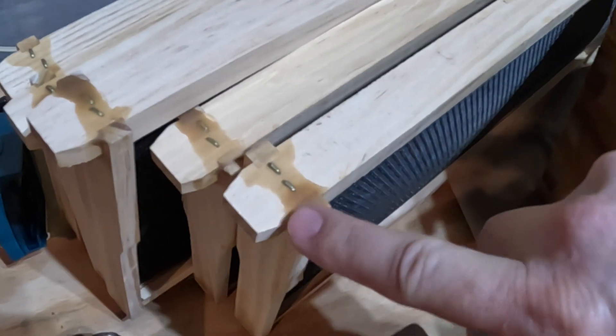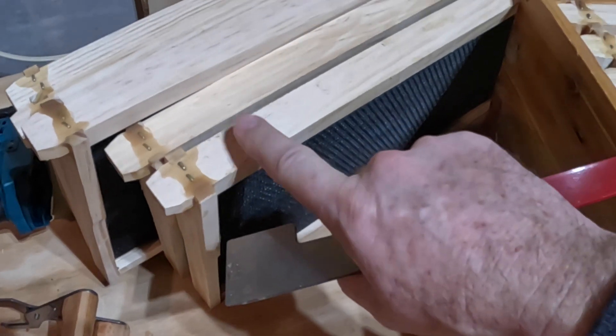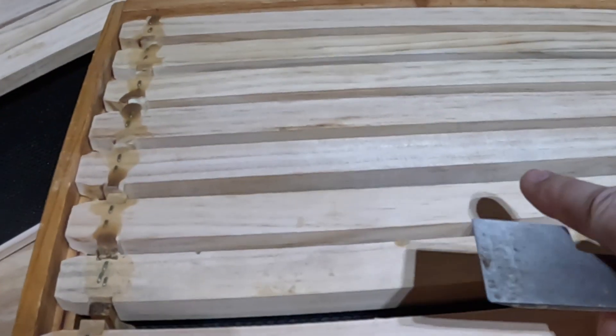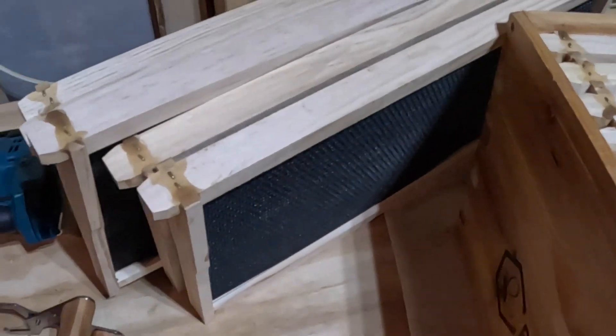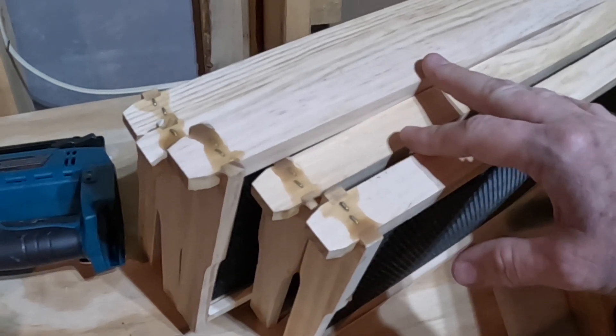On frames that I've recently made — and I've got a stack of them right here — I make sure there's a ton of glue. I put staples in them too. Glue is the key; the staple or nail is really just to make sure it's glued together well. So many times on YouTube videos you see people working frames and you don't see many come apart, but in reality — at least in my first year — I had several frames come apart because they weren't put together well, and I wasn't knowledgeable enough on how to properly break them apart before prying.